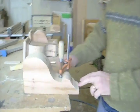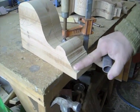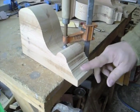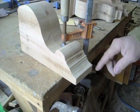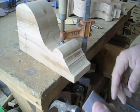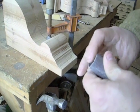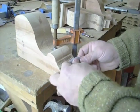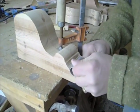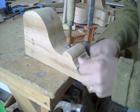You can see right in here where I didn't do that good of a job — see how coarse the cutting is from the bandsaw. I kind of overdid it a little on the sander and lost my profile, so I'm going to have to doctor that up. I've got this little round thing — you can use a dowel that's about this size. If you put this in here and work it just a few minutes, you can get pretty much most of those bandsaw cuts out.